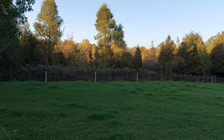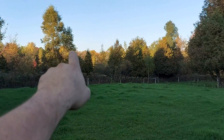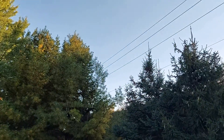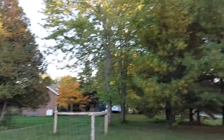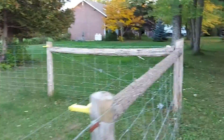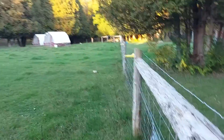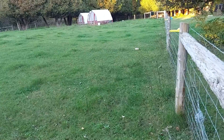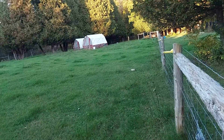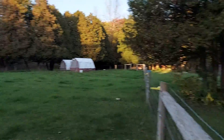I could do a beverage starting from this corner and following the whole line down that way — go way back in the bush if I want. We have these power lines here but there's nothing too big to be concerned about. I realized I was mistaken about interference because it wasn't working — turns out I had the wrong coax hooked up to the rig. Like I was saying, this wire just loops through at the corner, free floating, because when animals put their head against it and push, it can stretch a little. You can put a turnbuckle in line and tighten the whole thing.